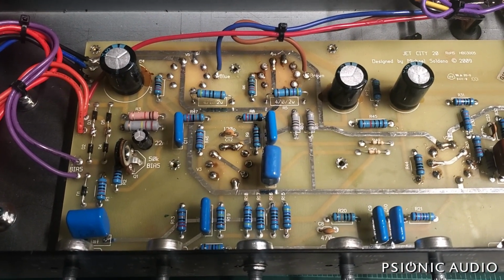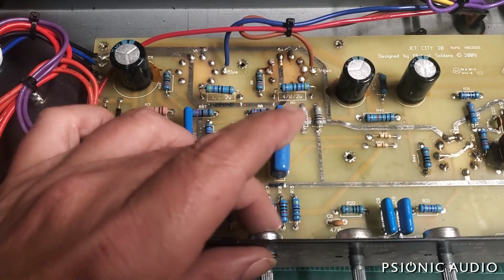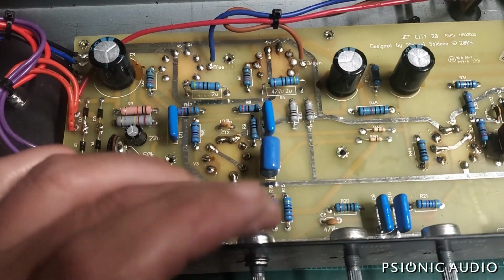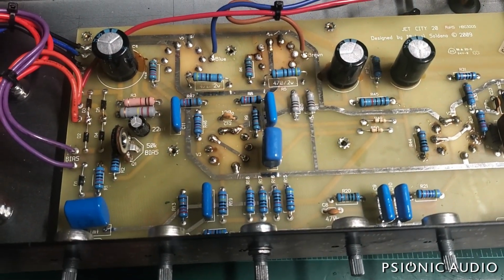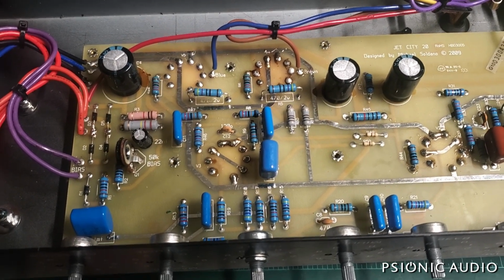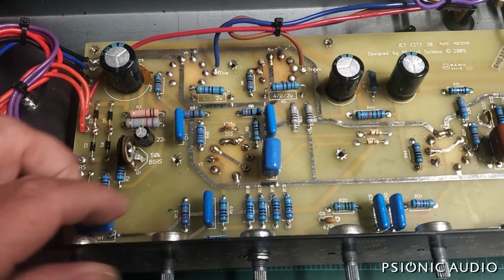Number one, it would have made the entire thing silent when pressed up against the chassis, as you heard. Second of all, it would have acted as an antenna when the shell wasn't against the chassis, which might explain the buzz that we heard when we did have sound. Anyway, it was a $2 pot, so rather than just fish out that piece of metal, I put in the new pot.